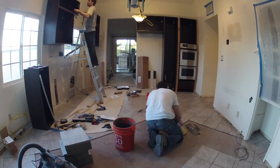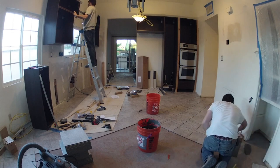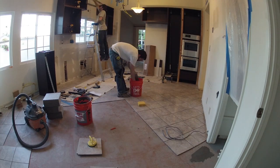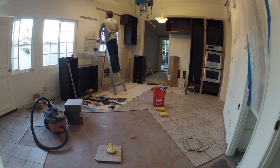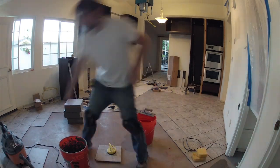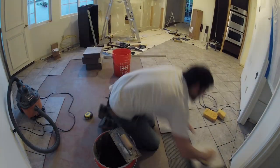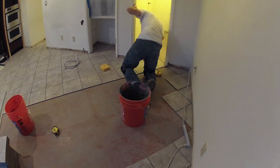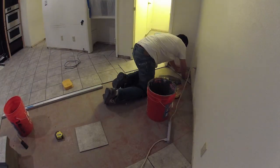Now you can see I've moved on to this set of upper bridge cabinets — the horizontal ones. I've installed the bracket and done the initial installation, and now I'm laying the upper cabinets in there. The challenge with this set of cabinets is that the brackets have to be aligned to within about a thirty-second of an inch vertically, so the weight is held by the wall brackets. Then I can screw the cabinets together to lock them and secure them as one large upper cabinet piece.